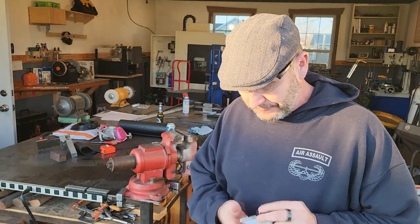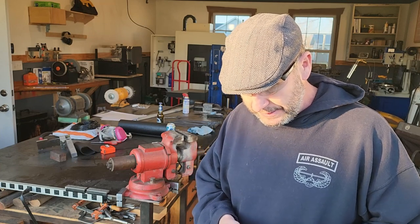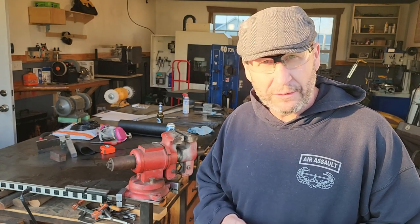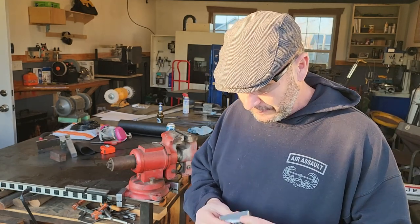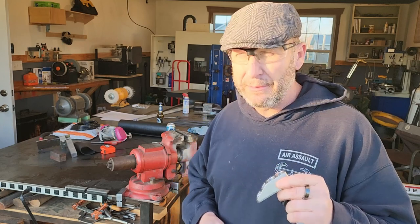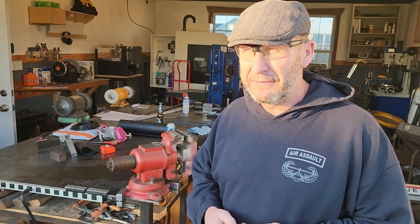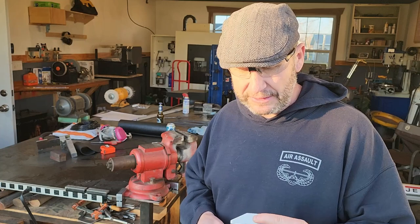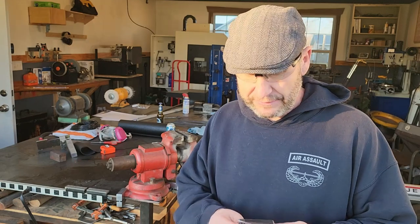All right, so with this part, I wanted to clean up my contour and remove the snipe. I did that. I played around with the settings. I let in at about 20 degrees, but I think the real problem was the very last pass was taking the biggest step over. I was taking two skim overs and then a big step over, and I was grabbing into the part and sniping. And so by reducing the maximum step over to half a mil, I was able to have a nice finish pass.